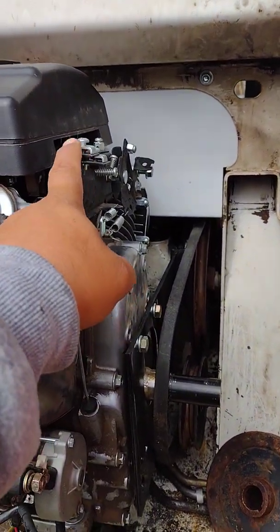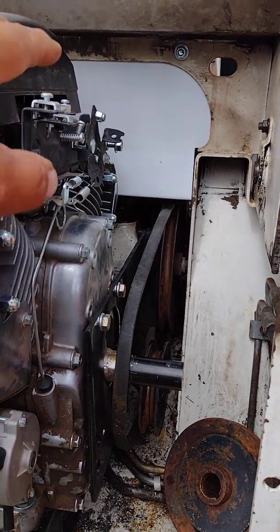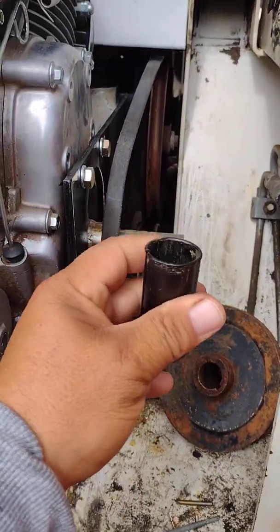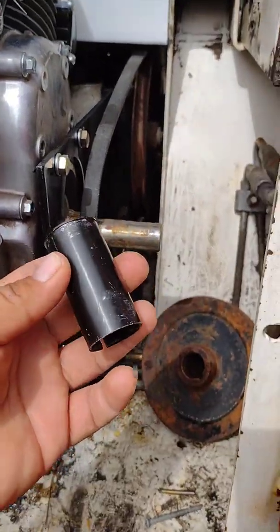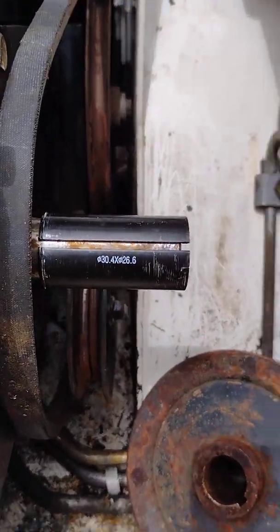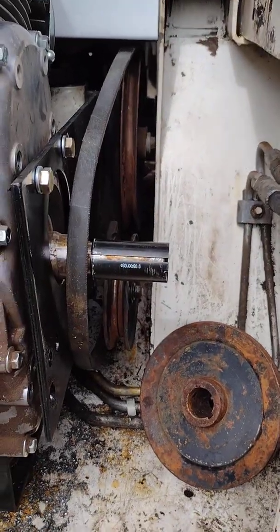You're not going to believe this. I was going to look for a throttle cable — did you know that on most go-karts and mini bikes you can take an old mountain bike, take the brake cable off the back, and it's long enough to run a throttle on your mini bike, go-kart, or this skid steer? While I was looking at the throttle cable, there was this sleeve where the mountain bike seat goes. The seat was missing and I saw this adapter and said, 'Wow, that's similar to the sleeve that goes inside the pulley onto the shaft.' The numbers were kind of awkward but off a mountain bike the sleeve fits, the pulley goes on — I can't believe it. I just need to cut a little more so the pin slides through perfectly, but it worked.